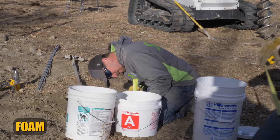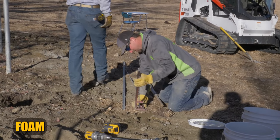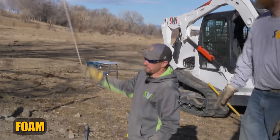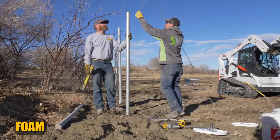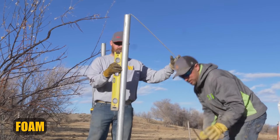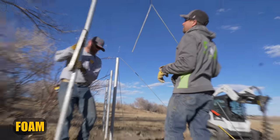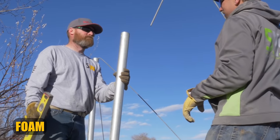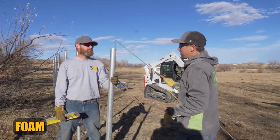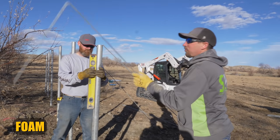So we've got six and a half, which would be three and a quarter. What we're going to do is take some truss rod and use that to stabilize our post and hold it level. We're going to use this to pre-level out our post so we can just pour the foam in. This method works really well, especially if you're core drilling or grouting posts in concrete and you don't have time to hold each individual one.